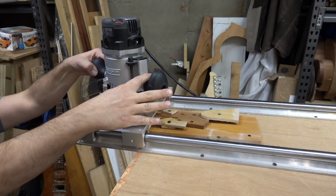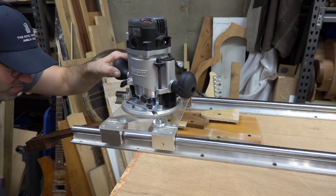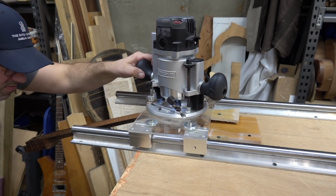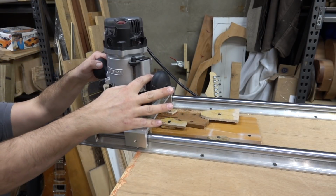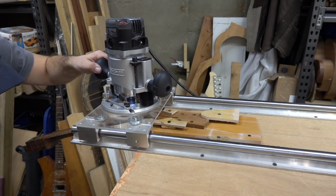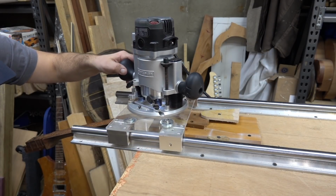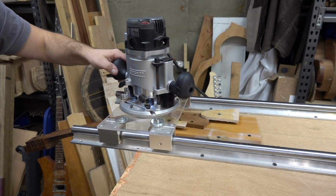This is a Craftsman router with that 1/4 inch bit, and where each sort of crack in the neck was that had some Bondo, this is going to put in new mahogany to replace that. And so I've got some screws holding this down with some wood through the tuner holes, and I'm making sure just to go slow and get this right.